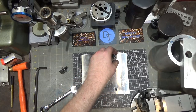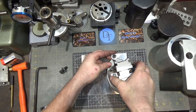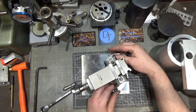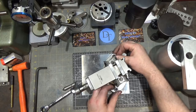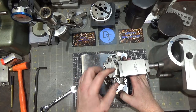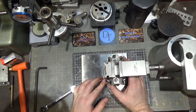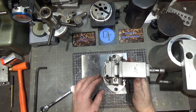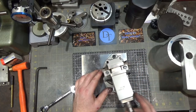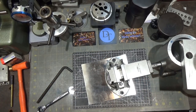I got these screws at a really nice length — I didn't have to trim them. I can rotate this out of the way to mount it; I want it roughly centered between these two. I purposely didn't put the screws all the way up against both sides because I want some rotation range. What I've got to do is take this over to the surface grinder, put this up against the fence, then use an indicator and go along the edge with this set at zero degrees, or 90 degrees — once I get one right the other will be right. I'll soft tighten these for now and head over to the surface grinder.